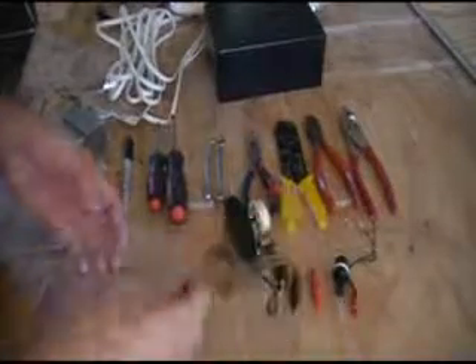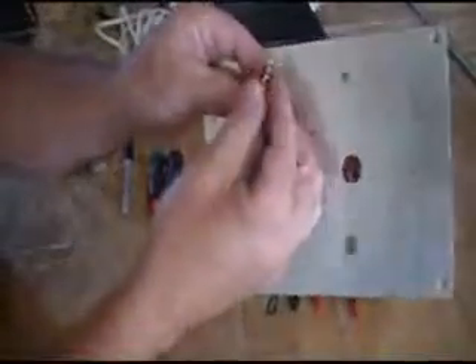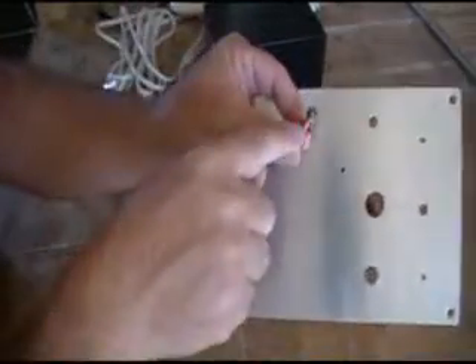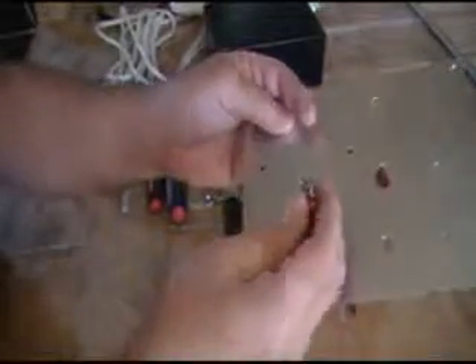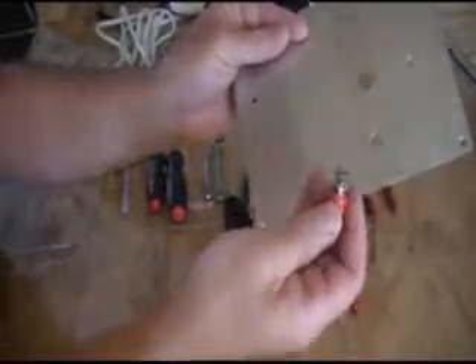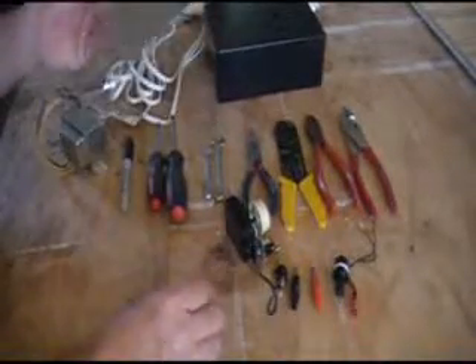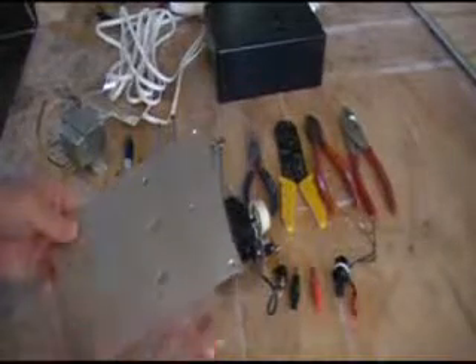Since I have the metal plate, I've got to watch out for shorting out. So I'm going to drill a big hole that will cover the circumference of this here, and on the plastic I'm going to drill a small hole that will just fit the screw. It should be safe — it shouldn't ground out, because the plastic around there will protect you from shorting out on the metal. I hate to put my back to you but I'm going to go to my drill press — I'll be back and show you the final result as far as drilling goes, and then we'll start assembling.